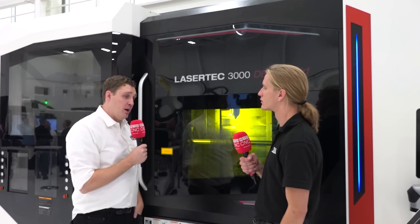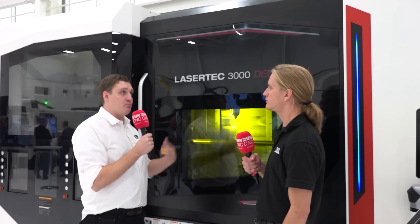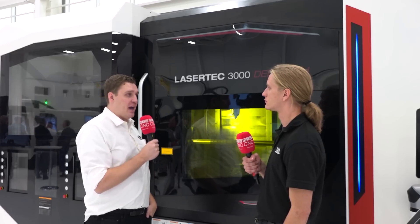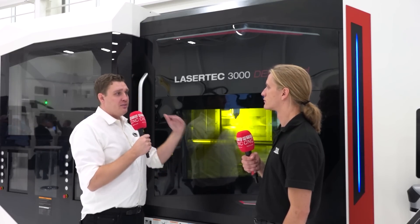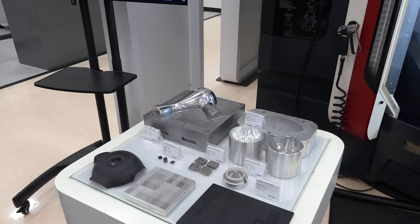No, you don't. We typically quote the properties of our welds to come out somewhere between cast and wrought, though it depends on the application a lot. If you have a single layer coating on a big block of material, that coating is going to cool very quickly so you can get very high hardness. But if you have a really big buildup, that part is going to be hot for a very long time and will actually soften.